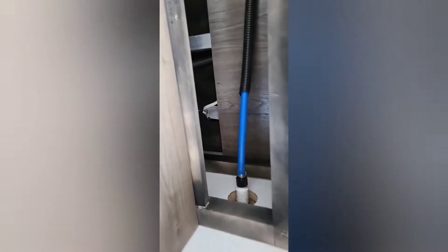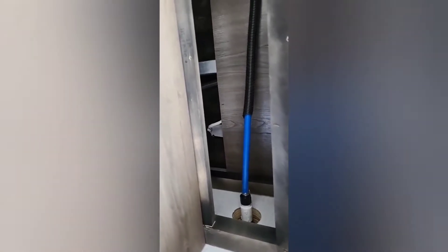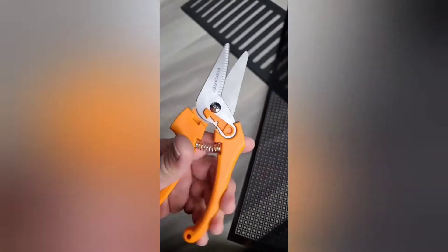With this piece here it should distract that view a little bit so it's not so noticeable in there. We may also take a piece of loom and finish that outside water spigot there, just to change the color so you're not seeing that blue through the stairs. What we did next is just took our scribe and made a mark at the six inch point — coming six inches down from the top and cutting a straight line across. We'll put a straight edge there and take a magic marker so we stay straight, then use our Fiskars shears and cut along our scribe line.